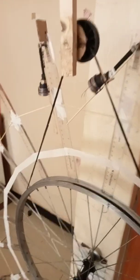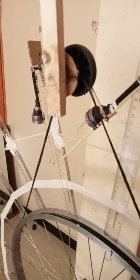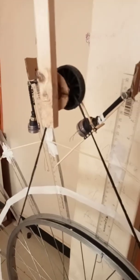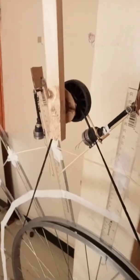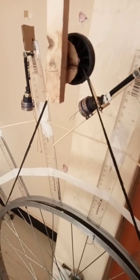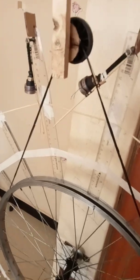The other energy requirement is the belt which is driving the other pulley — of course some energy will be lost in driving this pulley using the rim, so that is another parasitic load. The major parasitic load is the energy required to lift the top weight. As I said earlier, the energy required to lift this top weight — estimated using the 180-degree curve that the weight follows — I estimated it at 4mgR.